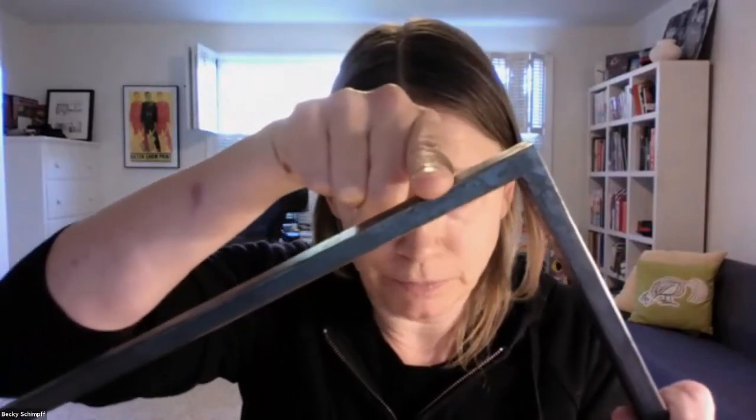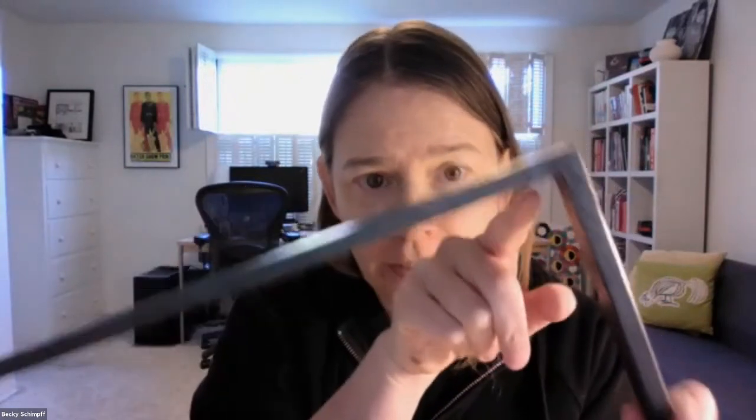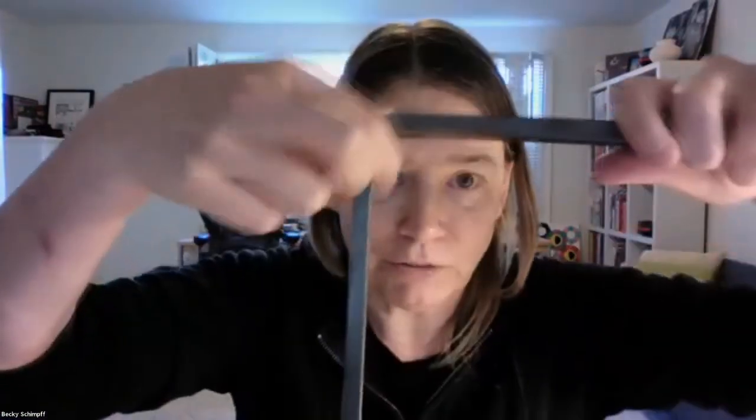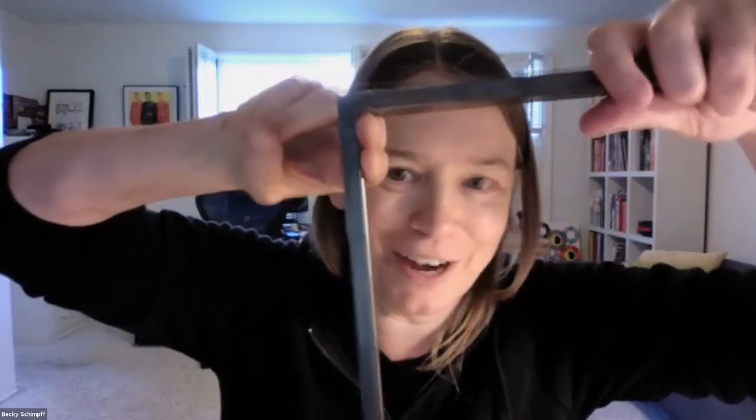And the answer is? Okay, so that's a great question. It's easy to make that first square corner. The second one, and this is just using the vise and the anvil method. Let's say you put a corner here and you bend it, you can put this leg in the vise and hammer here, but you can't get that in the vise. So you have to do it at the anvil. So the closest you can get using this is how you can get your hammer in there. So if you put a bend right there, you can get it wherever your hammer is.